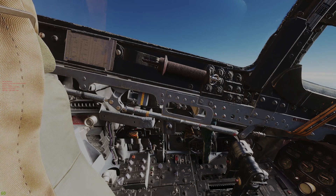This switch controls transfer of fuel from the internal wing tanks to the fuel cells. With the external transfer switch on, internal wing transfer is inhibited. So when your external tanks are depleted, you need to move the external transfer switch to the off position to allow fuel to transfer from your internal wing tanks.